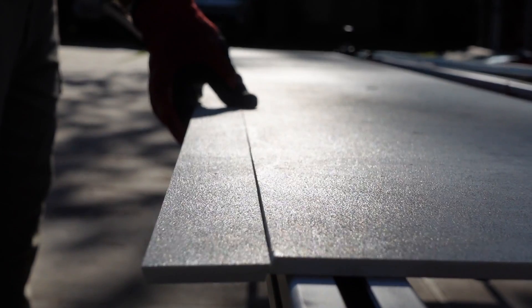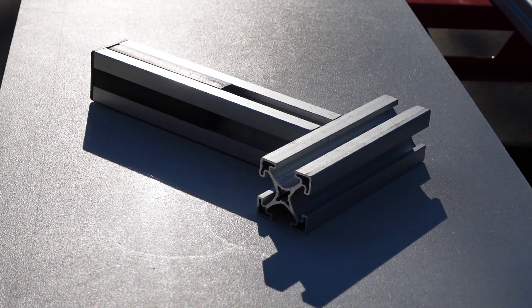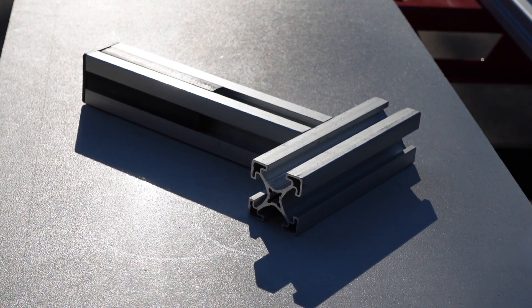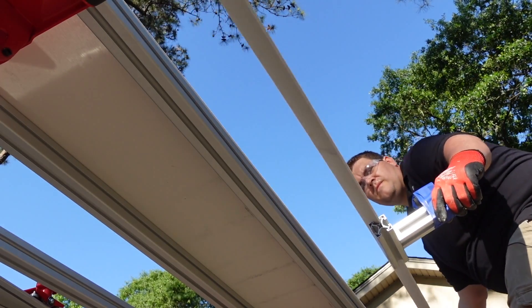The Ruby Slim Cutter is a simple to use and effective tool. However, it does have its limitations. When cutting smaller strips, it's difficult and somewhat awkward to have to break them off by hand — especially when doing this solo. I'm going to use a t-bar to help with splitting these small strips. Regardless, find a technique that works for you and is complementary to the Ruby system.